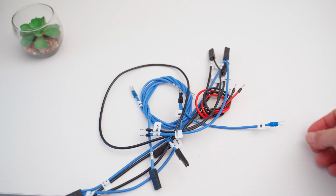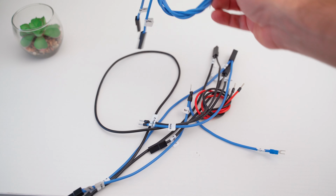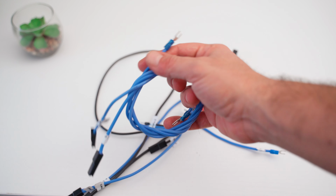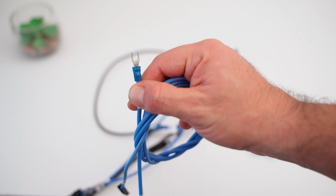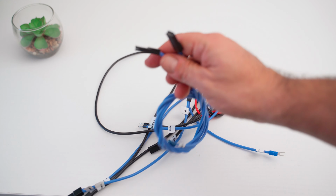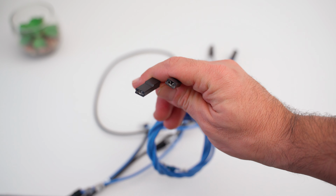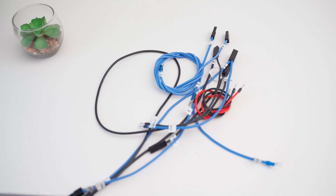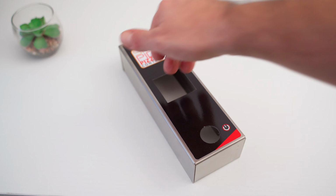Very important then are the cables, so we need the 14 AWG silicone wires with resistance up to 200 degrees Celsius. You can take 5 meters in total, 2.5 meters of one color and 2.5 of another. Obviously you'll also need insulated faston tips, faston terminal forks and so on. You can make them yourself or ask someone to do the job for you, just to save time. Like these you see here, which also have all terminals labeled for reducing chances of mistake.